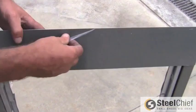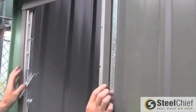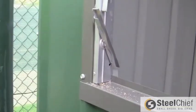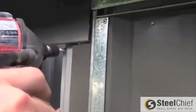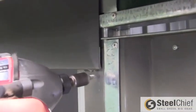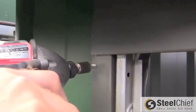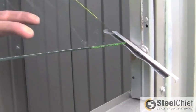If you have ordered our optional window, remove the plastic film from it and install it in the provided hole. Ensure it fits comfortably and then insert 1 screw per corner, 4 in total. Carefully install the glass pieces and lock them in place by firmly pushing the metal hooks over them.